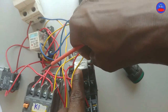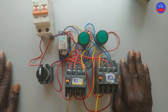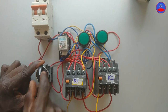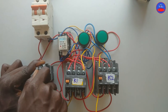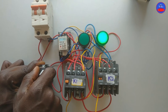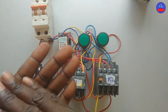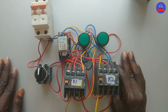We are done with the whole wiring. I will turn on the main breaker. K1, K2, or motor 1, motor 2 — these are the indicator lamps. When I turn on the selector switch, K1 would energize. When I turn it off, it would de-energize. When I turn on the selector switch for the second time, K2 would energize. When I turn it off, it would de-energize in that order. It is used in many applications such as water pumping systems. If you could not understand the whole process, I kindly urge you to watch the video again. This brings us to the end of today's video. I'll see you in my next tutorials. Thank you.